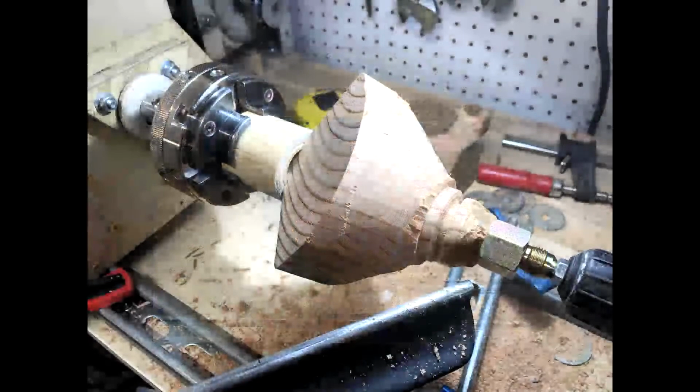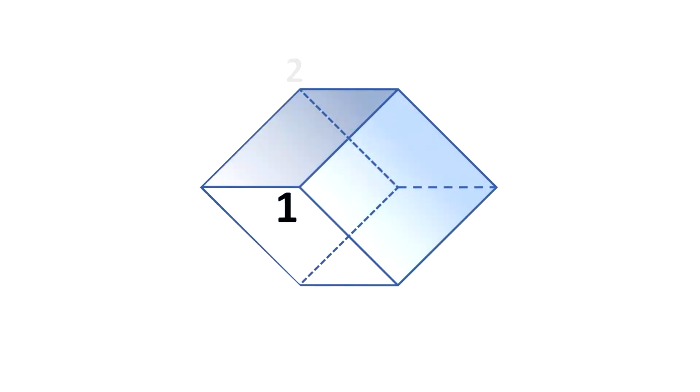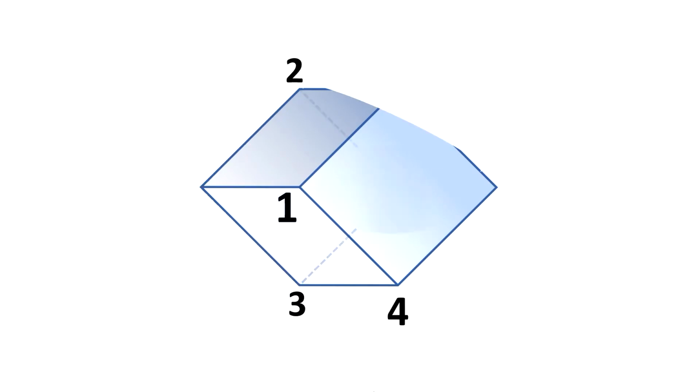of the bowl is already in process. A tri-corner bowl is turned from a cube, spinning 6 of its corners on the axis of the remaining 2, and in the process, 5 of the corners are milled away. Mounting the cube is a bit tricky.